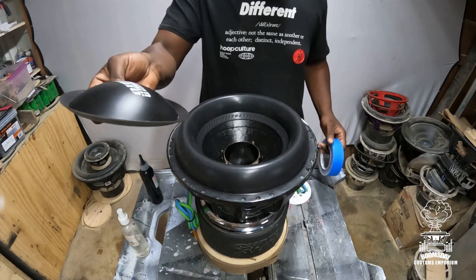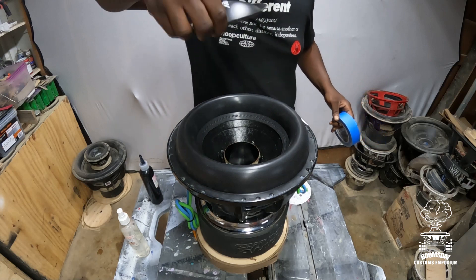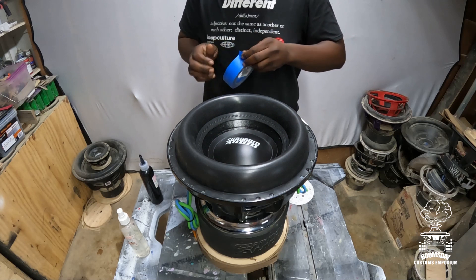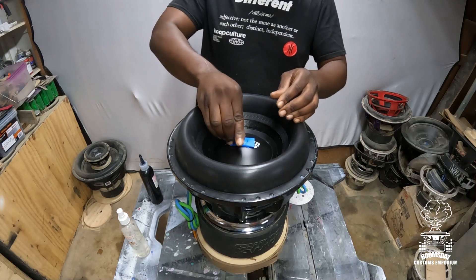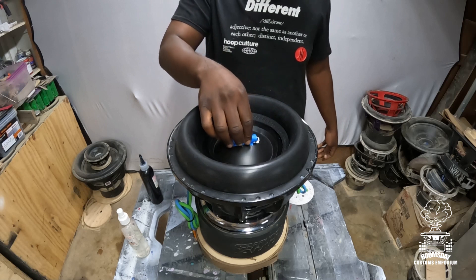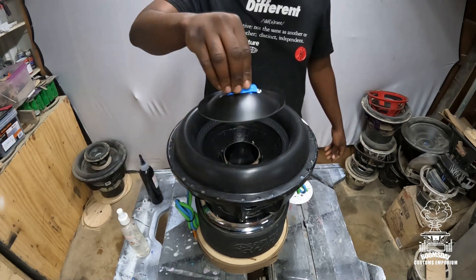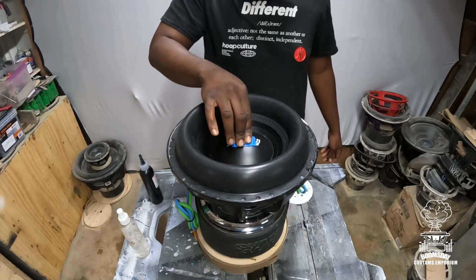Get your dust cap prepped and sanded. Take some masking tape, attach it to the top of the dust cap, and you can pick it up and set it straight down without worrying about it slipping or sliding. If you're uncomfortable, put a couple pieces of tape on it, play with it, go back and forth up and down until you get the hang of it — almost like learning chopsticks. Once you're comfortable, the next step is placing your bead of glue. Follow the ridge line on the cone, or follow the pencil line if you used a custom cap. It's okay if it runs a little — it'll just run into the former and won't hurt anything.